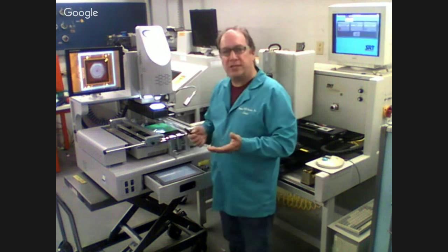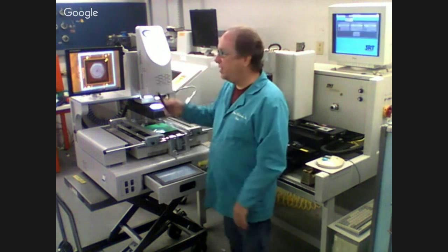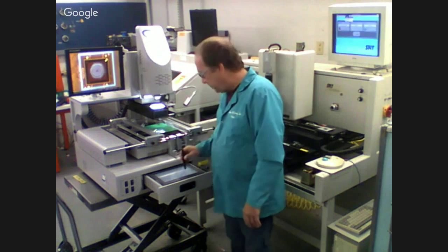Another feature of the Shuttle Star: the nozzles are magnetic, so they just snap into place — you don't have to mechanically fit them. The machine has a micrometer adjust for left and right, and also a theta for rotational alignment. This one has an electrical theta adjustment. Once I'm aligned and ready, today we're just going to do a component removal so we don't have to make this video too long.